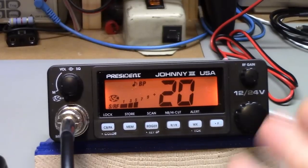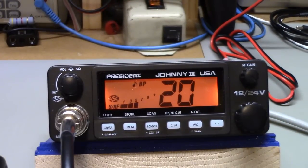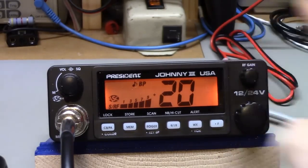I haven't done any adjustments to this. I was actually really surprised — this radio was 4 watts out of the box, or a gnat's whisker away from it. It's crazy how close it was. Modulation is at about 92 to 95%, but the power was right at 4 watts on this. Surprisingly high for a stock factory radio — usually that's the one thing that needs to be turned up if you send a radio in for alignment. This one was pretty much right there already.